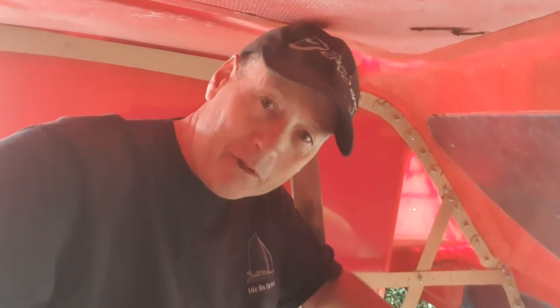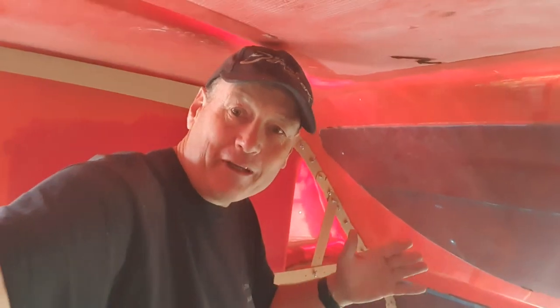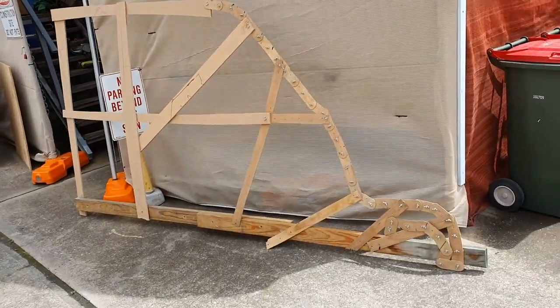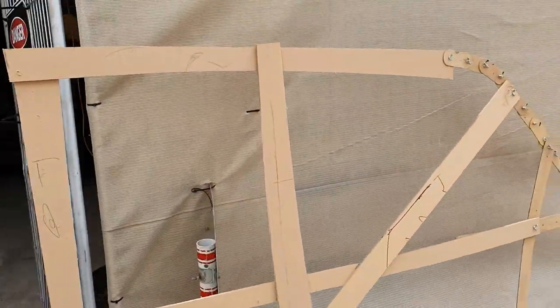It's actually shaped so that it's going to fit and physically adhere to the physical deck as it caps over the top. So the more work I do now, it'll actually save me work in the long run — and that's the thing with templating. If you're prepared to do the extra work early, it'll save you a hell of a lot of time in that finishing process. We got it out — we're having a chance to film it — but that's it, that's the shape of my deck back level with the hull side. Very, very good.